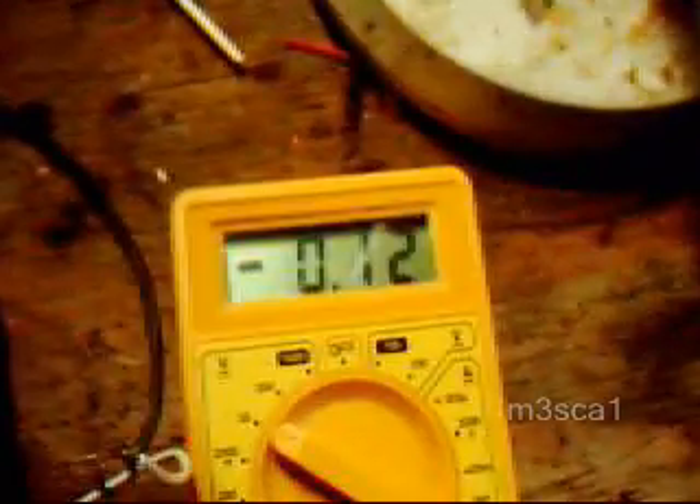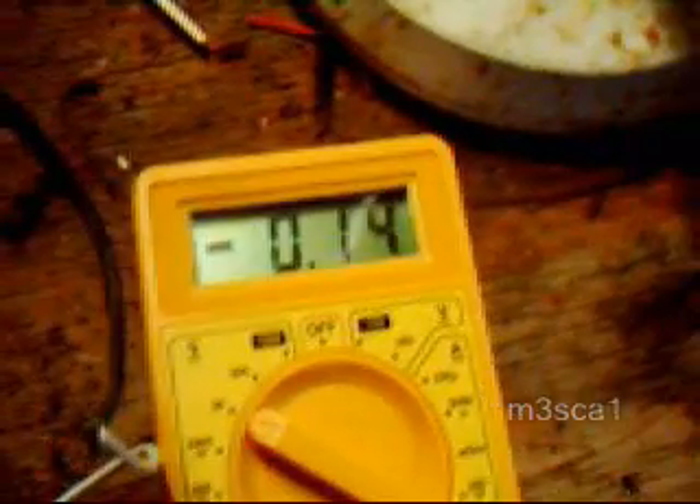Now to the oscilloscope — there's the signal we're seeing. Here's the voltage on the bridge rectifier coming off the primary side. There's no connection to this device at all, there's not even a ground wire to it yet, and you can see we're getting something there.